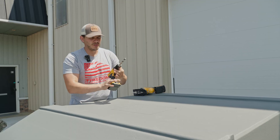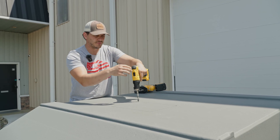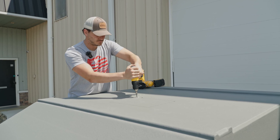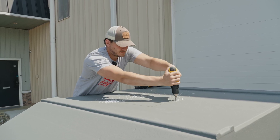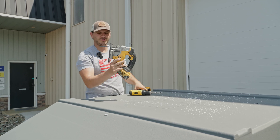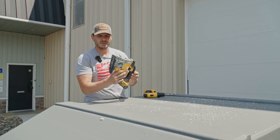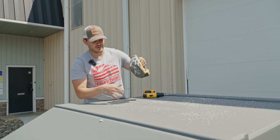I like to use the drill to make it easier to drill into each corner and then go ahead and cut out the hole. You will need a fairly long jigsaw blade — this roof is two and a half inches thick of high density foam. You can find these on Amazon; they're just longer bits than what your standard bit will be, but we found that's key for making a clean cut.